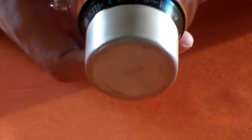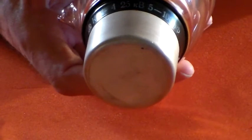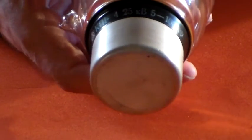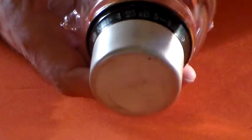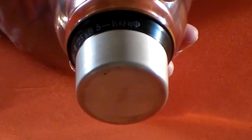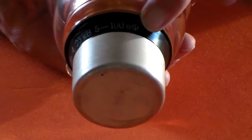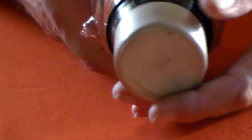Now, if you get any of this stuff from Russia, you'll see this sort of thing written on it. It says 25KB — a little K, big B — that means kV, which is Russian for kilovolts. So that's 25 kilovolts. Then 5 to 100, followed by an N and a circle with a vertical bar through it — that's Russian for picofarad. So if you see those markings on these capacitors, you'll be able to tell what they are.